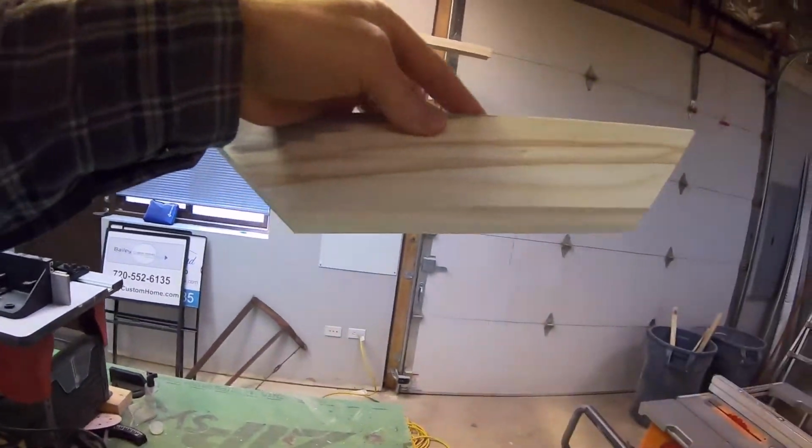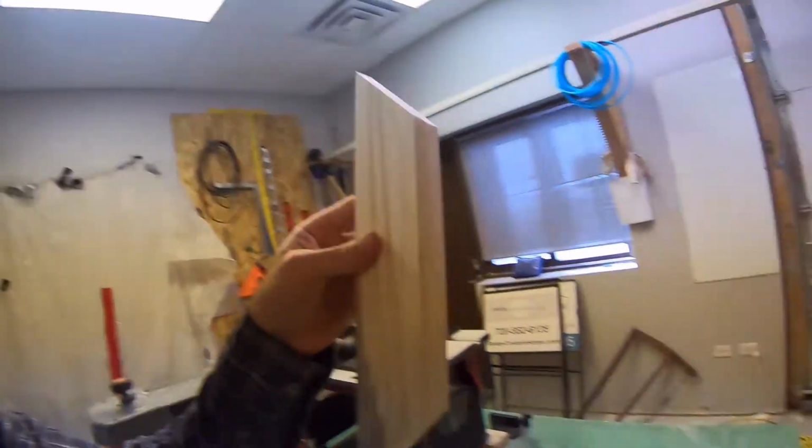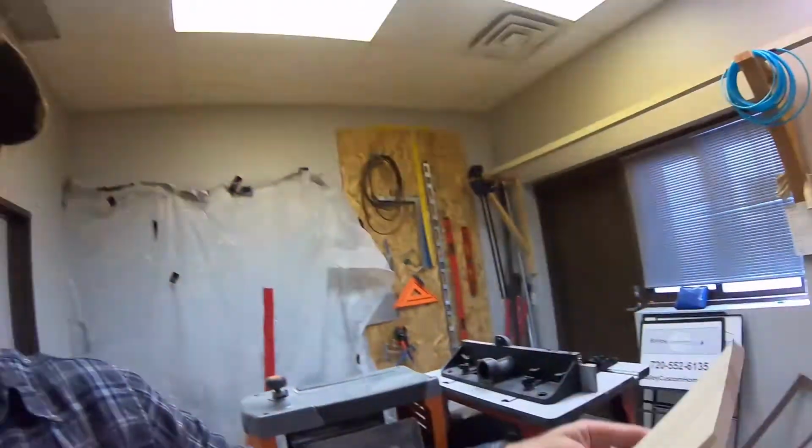Okay, so a couple tips on how to figure out your actual cuts and your dimensions for these once you cut the miter. So you can see my first piece cut here. This is going to be, again, an 8x10 frame. So the actual picture size itself is going to be 8x10. So the frame on the front end is going to be bigger than that, obviously, because we've got the back end here that's cut out with that dado cut. And so in order to figure out that distance, I have to measure short point to short point of each one of these pieces, the dimension of the actual picture frame.